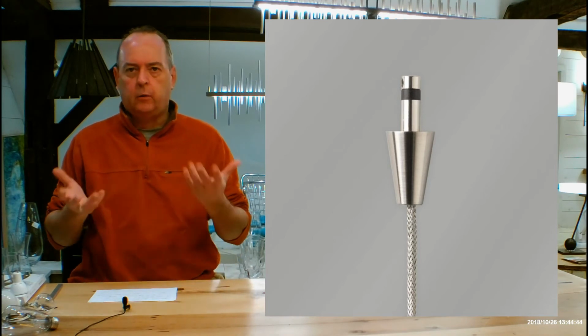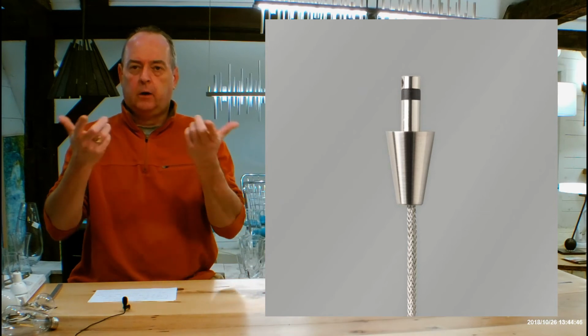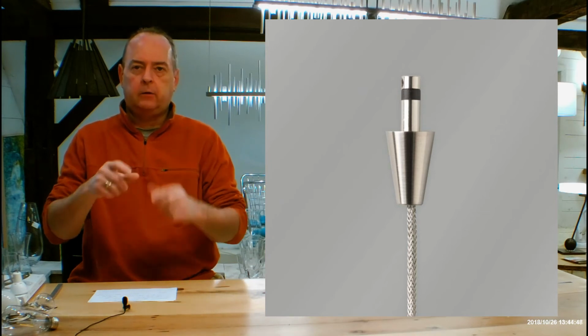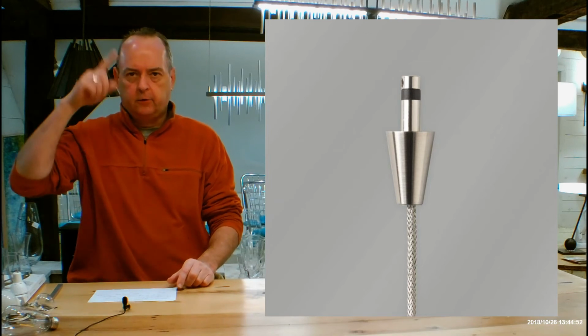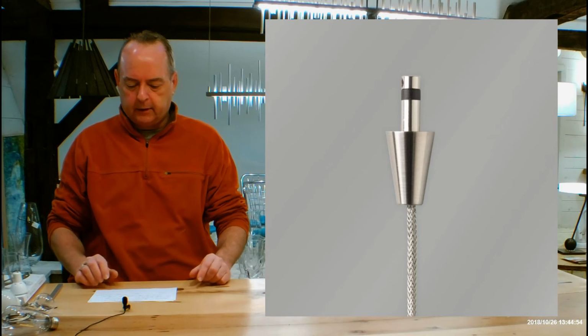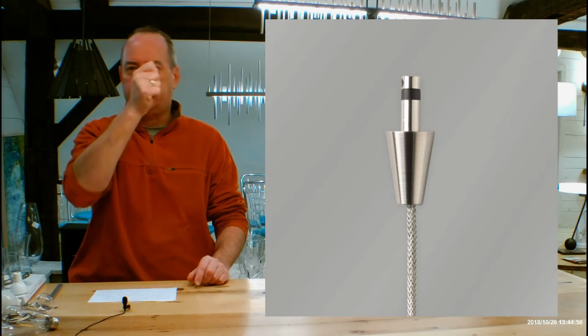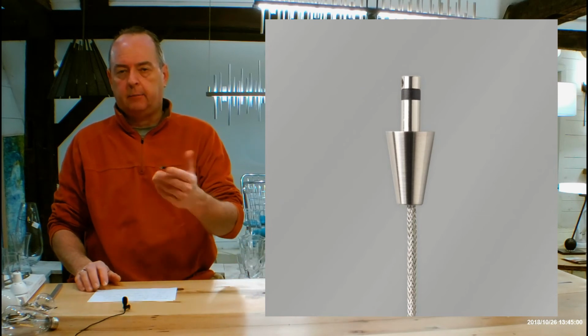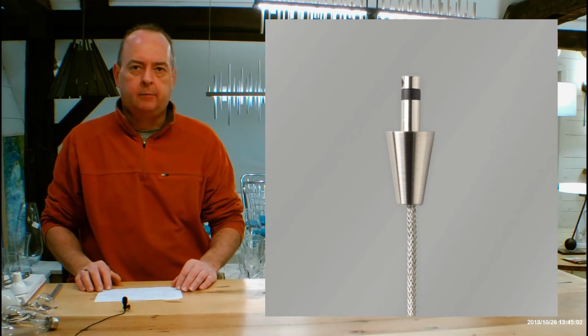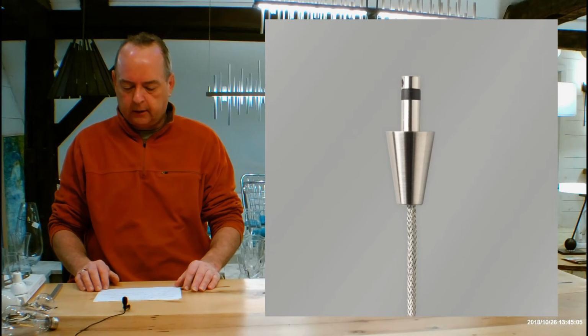So what happens is you don't get the traditional big, 5.5 inch diameter canopy. You just get this little connector, and you can trim your cable to length to get it to your desired length from the ceiling down to the bottom of the fixture, and then you just plug it into their ports, the ports on their canopies. So go to techlighting.com and just check out all their canopies, and it'll kind of go from there.